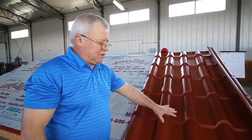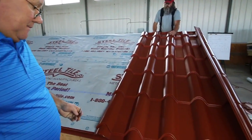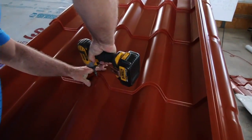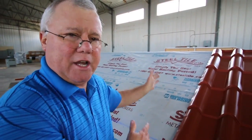Once your first panel is on the line, just put a couple of screws in the bottom and a couple in the top. Don't put too many screws in because you may not be going 100% square and you don't want to have to take them all back out. Just put enough screws to hold the panel in a good position so you can try fitting your next panel.